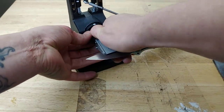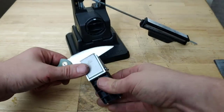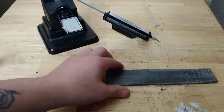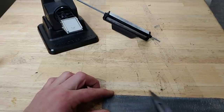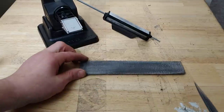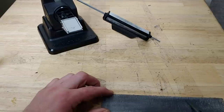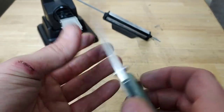Let's loosen this thing up — you can just pop the knife right out, then loosen it up so you don't have to loosen it inside the machine, which is very handy. Just click it right back in. Now let's strop it, then look at the edge, then test it, and compare it to a couple of other edges. I'm stropping it on a leather strop with white compound — white compound seems to be my favorite. It leaves the most bite in the edge in my opinion.